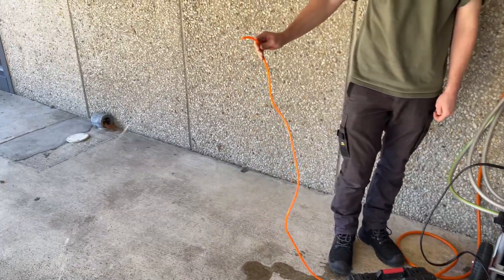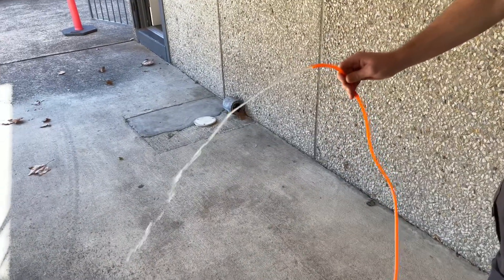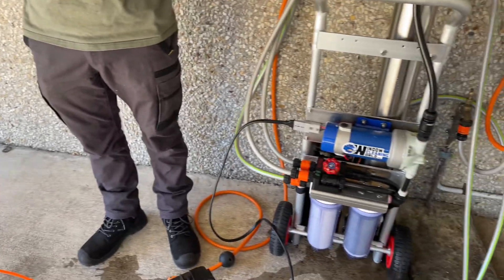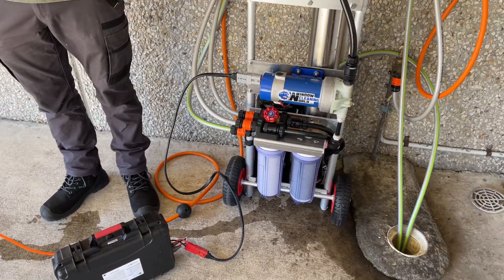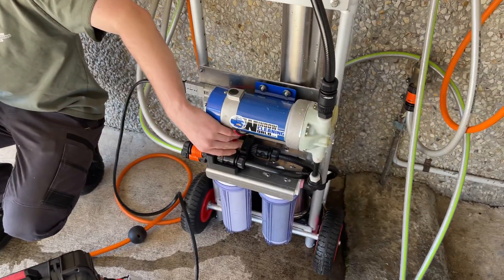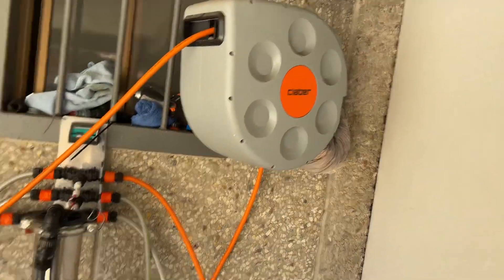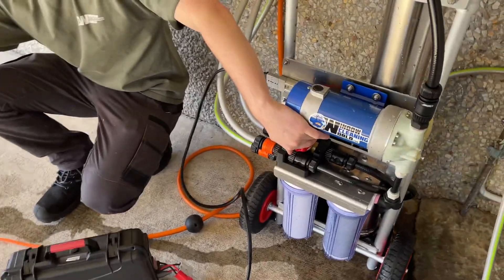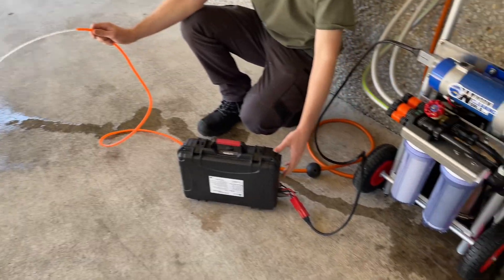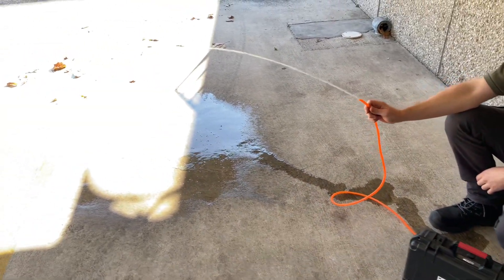Your results are going to vary a little bit depending on your hose setup, the brushes you're using, and how long your hoses are. This may not look like a lot of flow because this hose is all coiled up inside the hose reel. When we turn the pump on we don't want the waste valve cranked all the way down — we want some minimum waste flow, but open it up so we can then adjust. This is pretty much max flow without the pump. Julius is going to open up that valve a little bit, then turn the pump on, and we can decrease that until we've got the optimal flow we want.